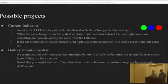Also, we thought about having a single battery system where we read the outputs in each battery, because batteries come in a four pack of 4 different batteries, and we can read each one with coding. But we never figured that out, and if you wanted to do it, you would need a different thing than the Arduino because it didn't have enough ADC inputs.